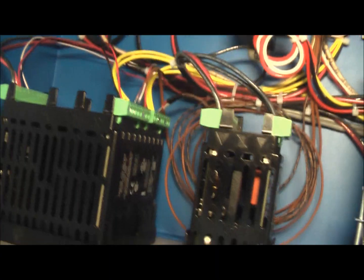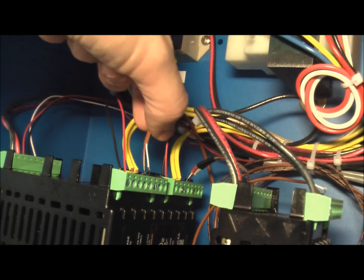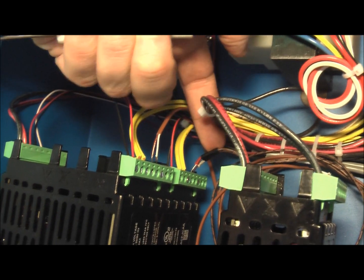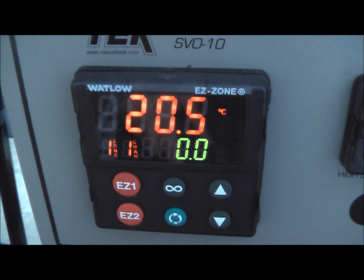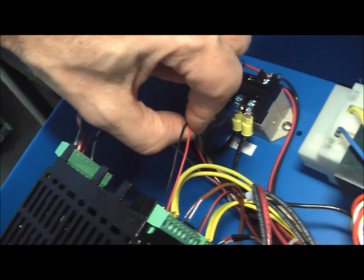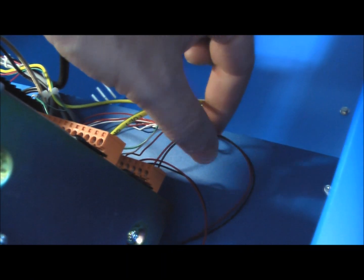And the red light went out, so that's our power circuit. Something we can look at here is the thermocouples. The probe inside the oven comes in on this top connector, and the probe outside on the heaters is down on this lower connector — that's for our cascade temperature control system. The temperature is displayed on the front of the inside probe: 205. It is retransmitted, and we've added these two wires to retransmit the inside temperature over to the data logger. The data logger has the same two wires here on the retransmit in channel number one.